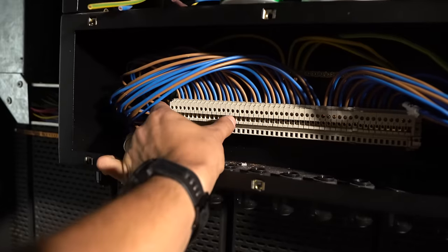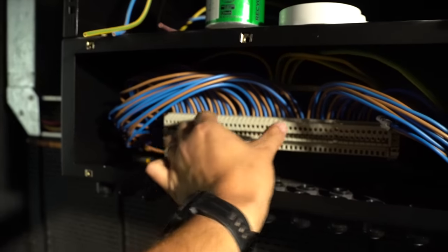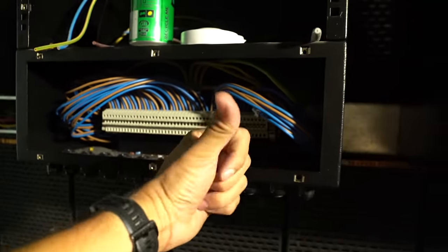One circuit for each one of those lighting bars going across. It's going to come out of the board and group the eight plugs for one lighting bar. I think there are five lighting bars out there, so we'll have five groups of connector blocks and then these will go straight through. We're keeping these now because we need one space for this multiplexer — the actual DMX thing itself — so that will go here and then be plugged into that socket there. We'll blank it off so it's useful rather than just wasting it.